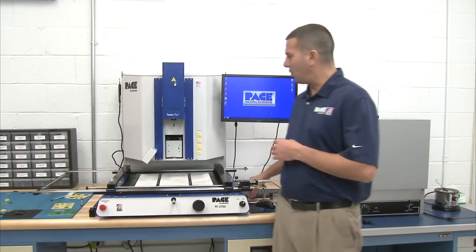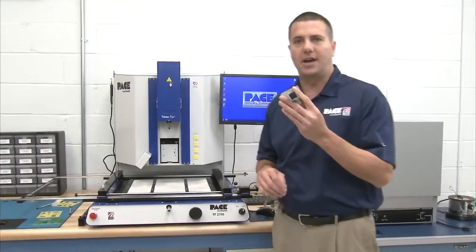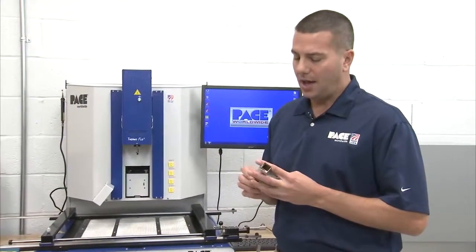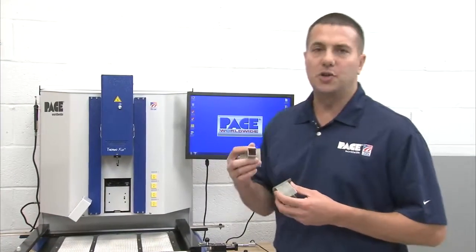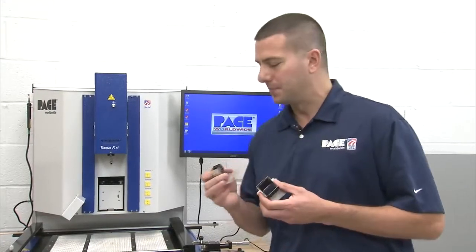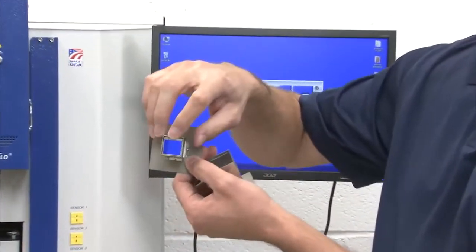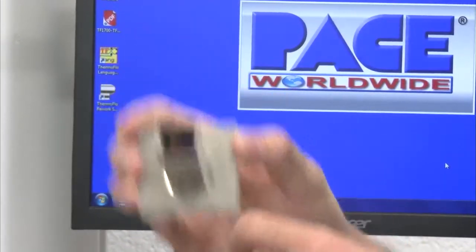And on the head, in order to direct the airflow where we need it to go, we use what we call our component nozzles. We have over 50 component nozzles which are sized to the component that you're using. You don't necessarily need to be exact to the component dimensions. You can always be a little bit larger, assuming the real estate on the board allows for that. So here's a couple examples of the component nozzles. As you will see, they are vented, which promotes thermal airflow and efficiency.